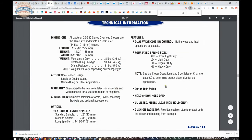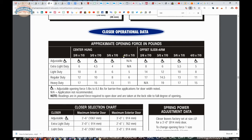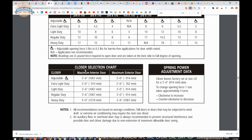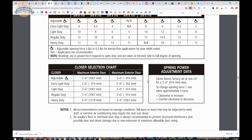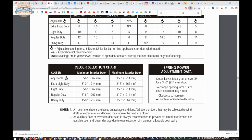Back to the page we're working on — this table from the original documentation is very helpful. It addresses door size, tells you what spring size you're working with, and gives minimum and maximum door sizes for interior or exterior applications. This additional information helps you funnel requirements down into the version you need. For this client it happened to be M02.